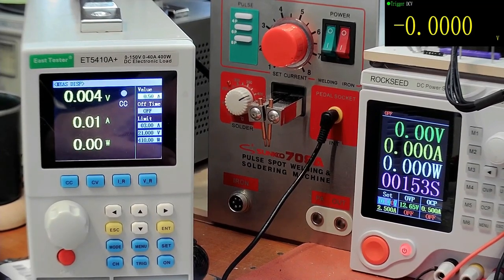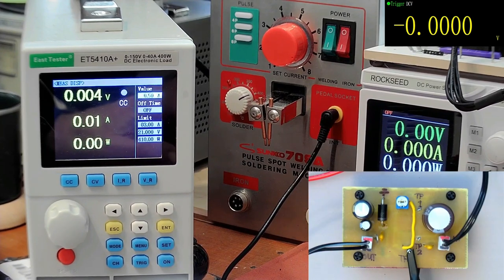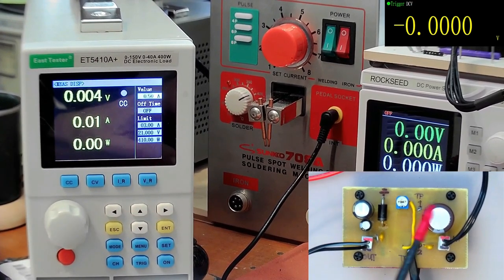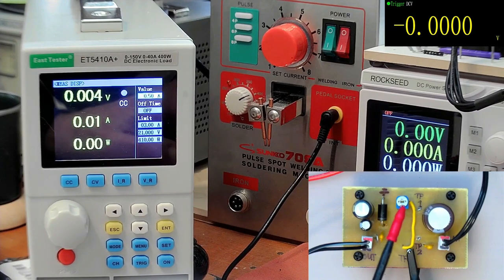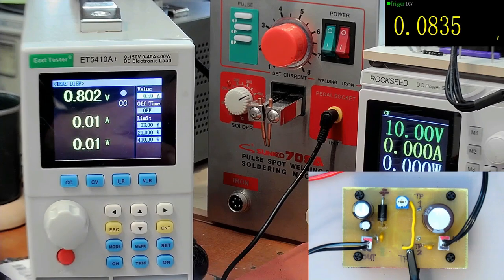Okay, so we have our little buck regulator built up and we're ready for testing, but not all is well. For some reason the adjustments are not working. This is it here, and that's the adjuster. I have checked the circuit, everything appears to be connected up correctly, but what we are seeing is no change in output voltage. So let's turn on the input supply. So we are giving it 10 volts,